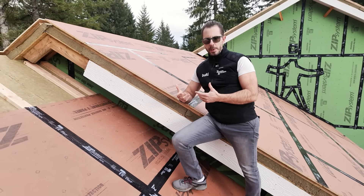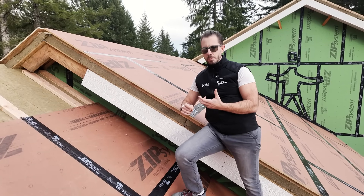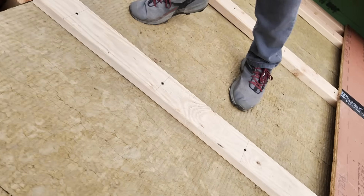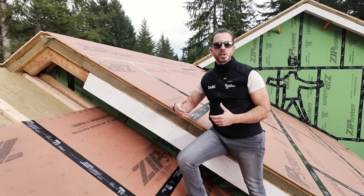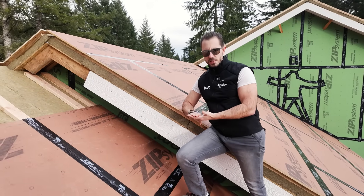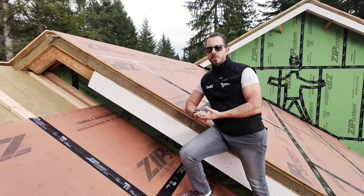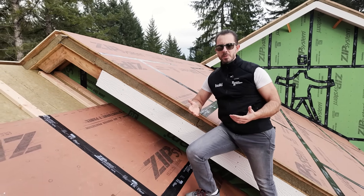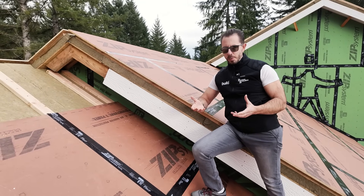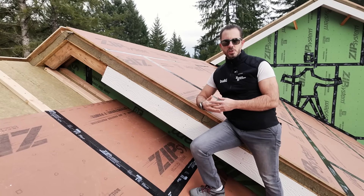It's comfort board instead of comfort batt. It has a high R-value per inch, but it also has very high compressive strength. So you're able to have your roof sheathing and have a snow load on top — or live loads — that isn't going to cause any appreciable compression. You would have to get many, many feet of snow before you saw compression. And remember, just because something compresses doesn't mean it's a failure; in practical terms, every material in existence has some sort of compressive strength to it.